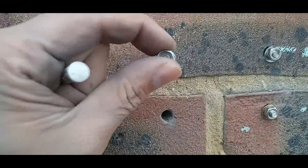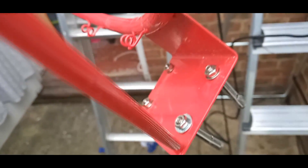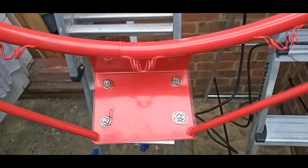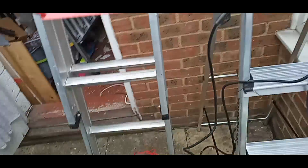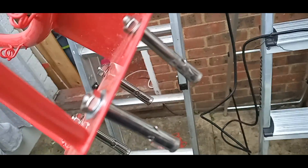As you can see now, I've drilled the four holes and I'll be fixing the bolts in there. I've put them in. The next stage is to install these bolts, engage the nuts, then align the ring with those four holes up there and tighten the nuts — that should expand the barrels and thereby secure the whole assembly.